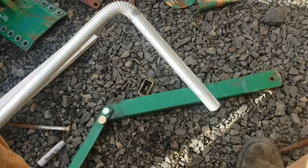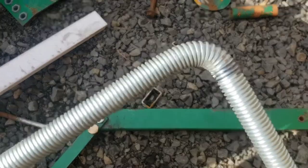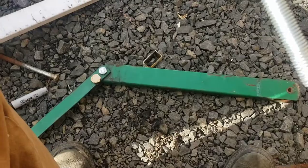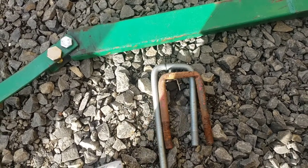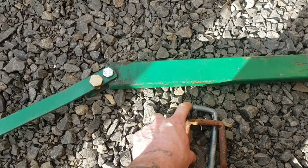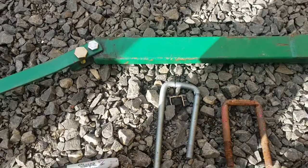There's my first bend — I went a little bit further than I wanted to, but that's all right, I'll bend it back a little. I also realized from my mark that it goes up and around the bolt, so now this end is a little bit longer. I gotta take that into account when I measure this direction before I make the next bend for the U. There's our old one and there's our new one for our first try — a homemade bender that we made ourselves. That's awesome.